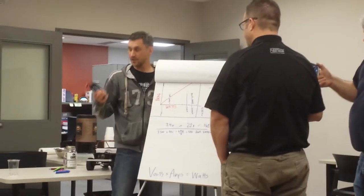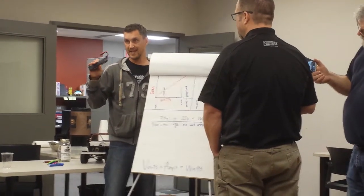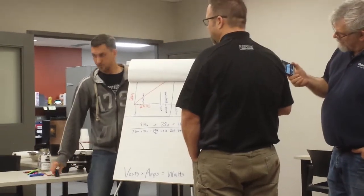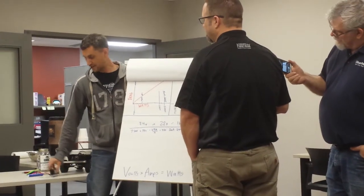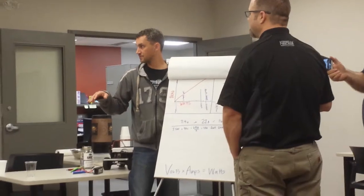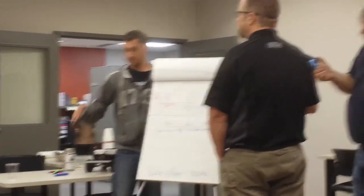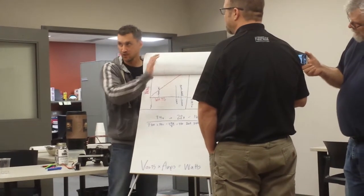A LiPo, the lithium polymer substrate in one of these batteries, actually ages. It starts to crystallize by itself over time. So buy batteries from a company who sells millions of batteries, so you get fresh ones. Don't ever settle for the one with all the dust on it on the back shelf, because it's already probably half crystallized inside. Don't buy it.